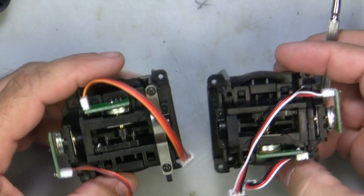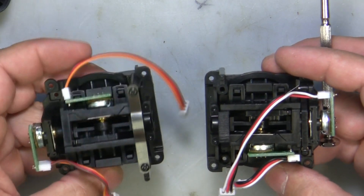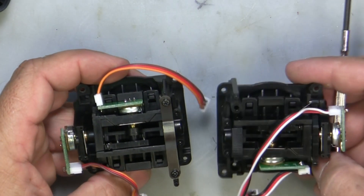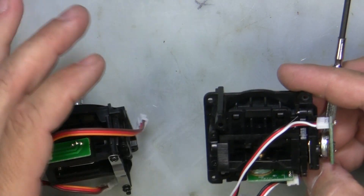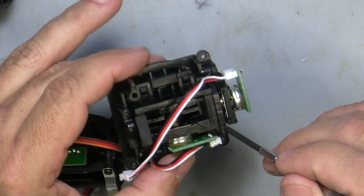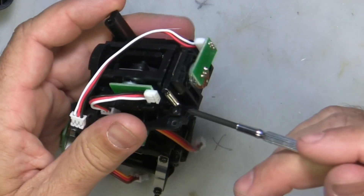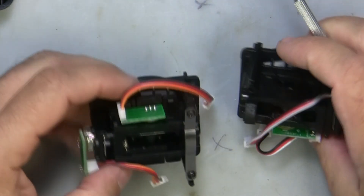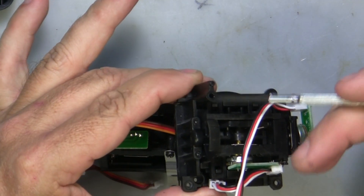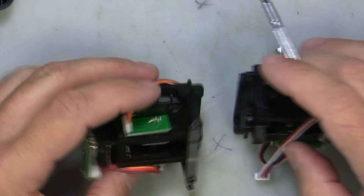Now that I've got the two gimbals out, I have to switch the rocker mechanism from this one over into the other one, and vice versa. You can't just switch the gimbals because the length of the connector cords aren't long enough for each side. So you've actually got to switch the actual rocker mechanism. The rocker mechanism is this little thing right here — there's a little spring here, the rocker goes across and connects in. We're going to have to take out that rocker and the spring, and then we're going to have to take out this little hook at the bottom and the friction band, which entails removing this post.